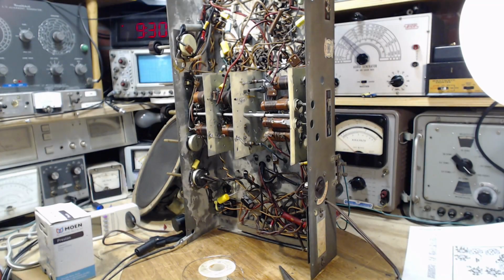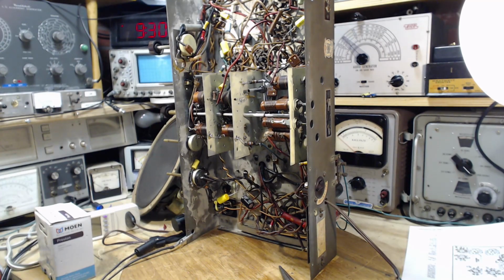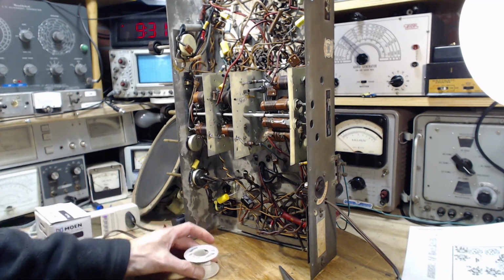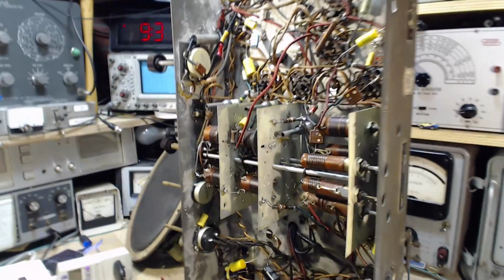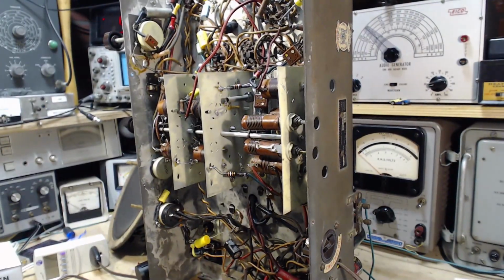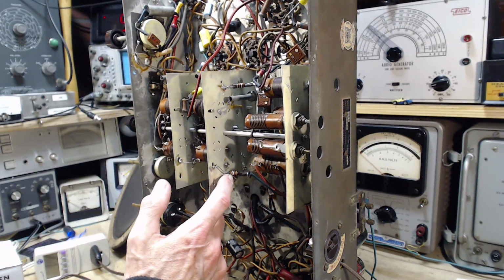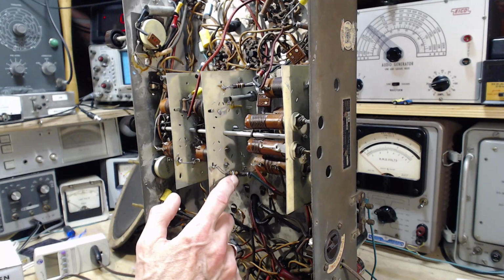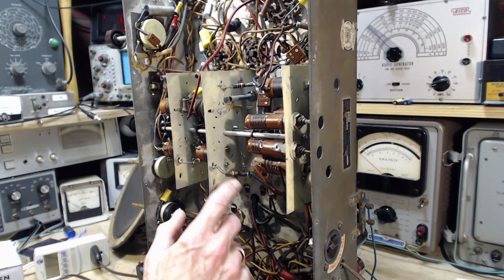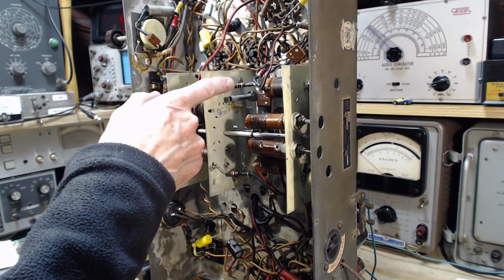Okay, I'm very securely soldered in that capacitor, so no problem there now. But here's another thing. And what did I do here? These two resistors that I've got in here, what's white? Is white 8 or 9? Maybe it's 9. 39K. Another one up here, 39K.